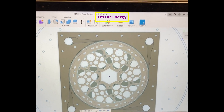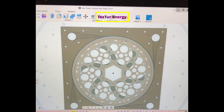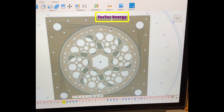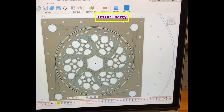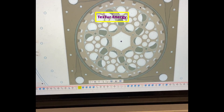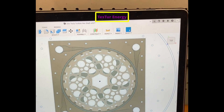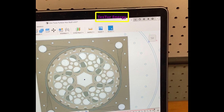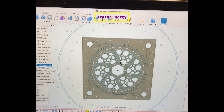The whole thing just goes so well together — it's a combination of the interstage heat exchanger, the water bearing style interstage coaxial sheathing, super easy to manufacture. And this also works as the intro to the multi-fluid vortex duct or vortex mixer, where the exhaust cold steam that's still left to condense and the cold water coming from the periphery will then be mixed in the second stage pump to further force condensation.